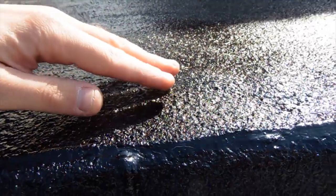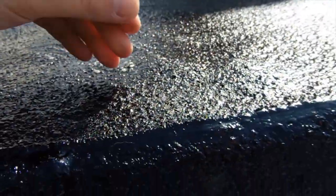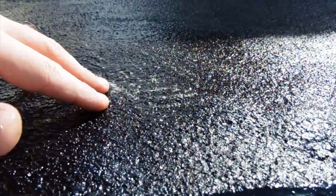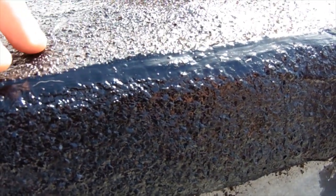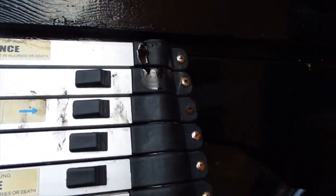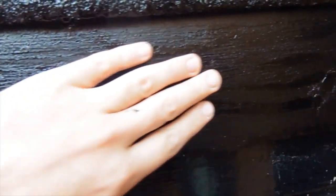It's now all finished. You can see all the way along. Just had a bit of rain and now the sun's come out. The water is just sat on top, running straight off it. It's given it an extra coat in a rubberised bitumen coat, so this should last quite a bit longer. You can see the edges - I've filled them with the gutter seal and then painted over the top of that. I've even gone along the edge here where the felt wraps over, and given this finishing board a coat as well.